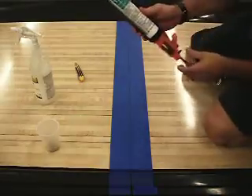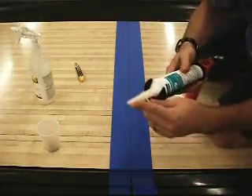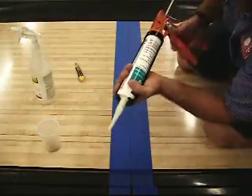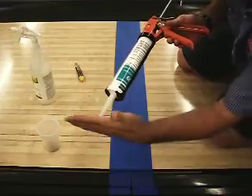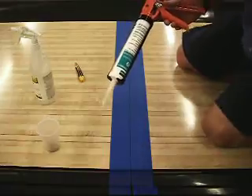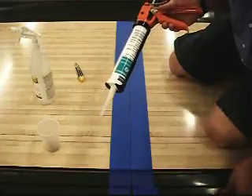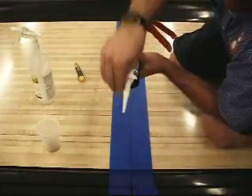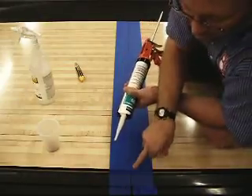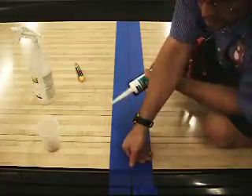Alright, now I've got my Dow Corning 1199. Cut off a small tip — as small as you can. As I run this tube along the panel, since there is an angle cut on the seam, I'm going to run the tube at that angle and try to keep it as flat as I can on the surface as I'm administering it, injecting it into the seam. A word of advice: don't seal your rounded edges first — seal those last. Start at the top and seal across.